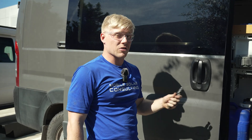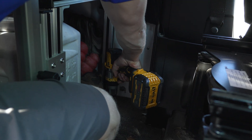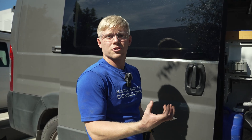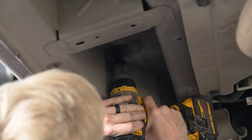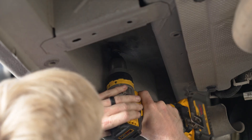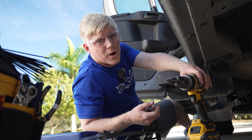Since we're going to be covering the wire with split loom, we're going to have to enlarge the hole in the floor that it went through in order to make it fit. I'm going to drill down from the top with a large drill bit and then drill up from the bottom with a step drill bit to smooth out that exit hole, and also to make sure the hole in the metal is larger than the hole in the wood floor so the floor keeps the wire from chafing against the metal. We'll spray a bit of primer on that cut metal and we'll be good to slip the wire through.